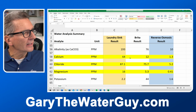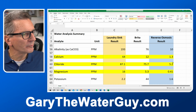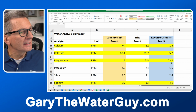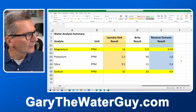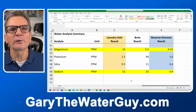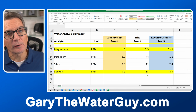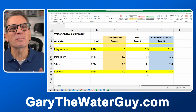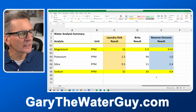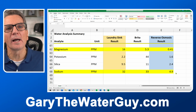And you can see calcium, 64 down to 12, ended up at 1.3 parts per million. Chloride, magnesium, again, a huge drop going through the reverse osmosis system. And sodium, salt. That's really what reverse osmosis is really good at. So it went from 32 parts per million to 33 parts per million. It increased slightly, but that's probably within the margin of error for the testing process. And through the reverse osmosis system came down to 4.9 parts per million.